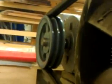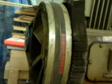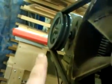And the last thing I did, put that down here, is I replaced the motor pulley with a 6.75. So anyways, I figured this pump to be spinning at about 707 RPMs, and the way I calculated that is the flywheel is 16 inches in diameter, and from all the specifications I've seen on B section pulleys, it's approximately minus 0.35 from the outside diameter. So in this case, about 15.65 is the pitch.